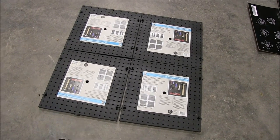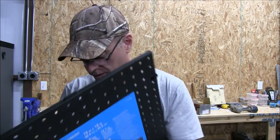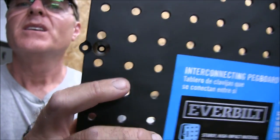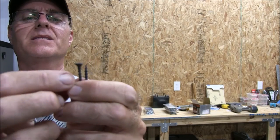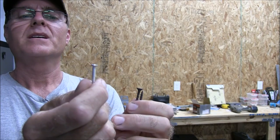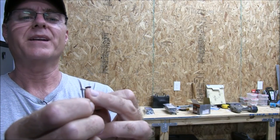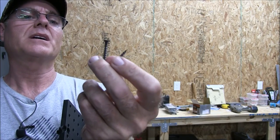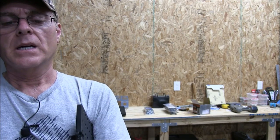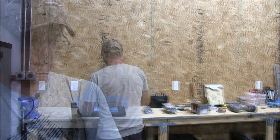As far as screws go, the screw holes they put in there are kind of limited to the head size — I don't know if the camera can get close enough in there for you to see. I was going to use these little screws that came with it, but I just don't trust the threads or the head — it's kind of small. So I'm going to use number six drywall screws, about an inch and a quarter long — I think that's going to work better.